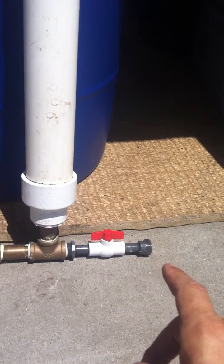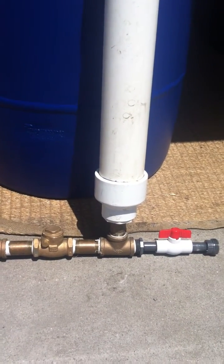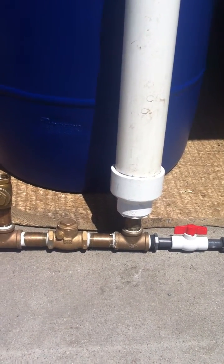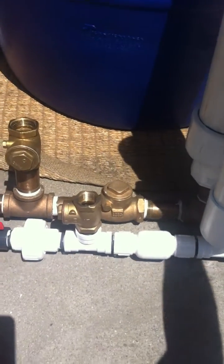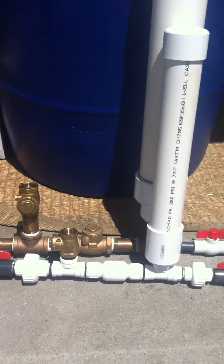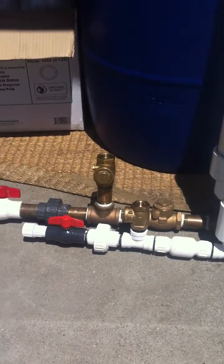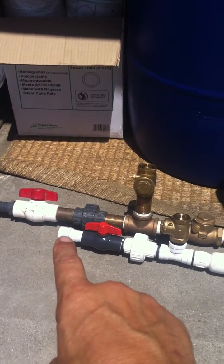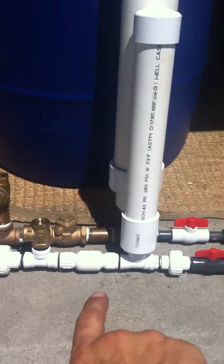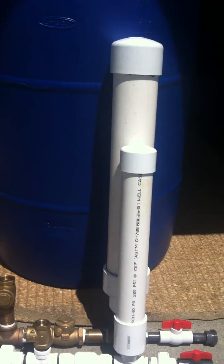Then we moved down to a half-inch delivery hose because we just weren't getting the water moving up as far as we needed. After several attempts I decided to scratch this one, because Seth had actually recommended we try a smaller ram pump. This one here is actually from Land to House — I wanted to support him since he supported me — and it's a three-quarter-inch drive, so we're going from one inch to three-quarter, which supposedly will make a really big difference. We're going to stick with the half-inch for the delivery pipe.